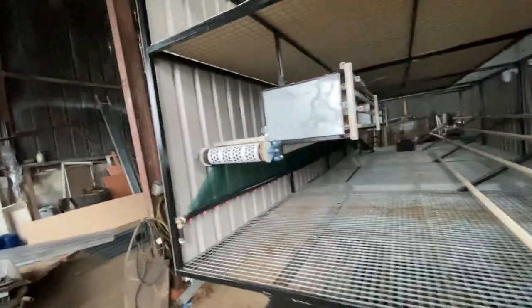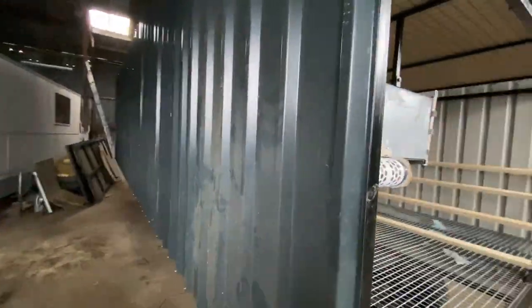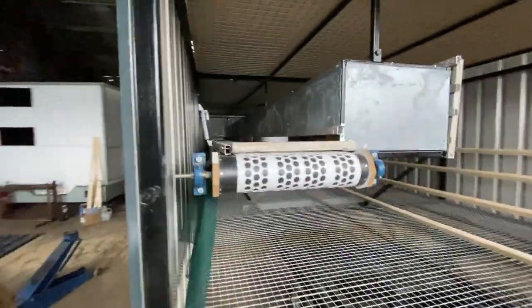I'm going to start to work on the front — how I'm sticking these on is just normal hex screws. It's six foot: one at the top, one at the bottom, now I'm putting one in every ridge all the way along and I'm happy with that. It's solid, it's not vibrating. Here's a joint — water's not going to get blown in on it. If there was some water getting in, I would just come along and stick some more screws in to close up the joint because I've only overlapped it one groove. It's too expensive to be overlapping two or three grooves. One sheet ends here and the other starts here — whereas some, if you wanted to be really fancy, you'd have one whole double overlap. But I'm on a budget, so that's not happening today.